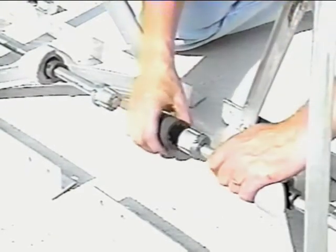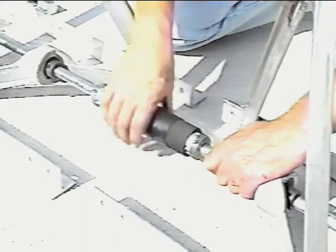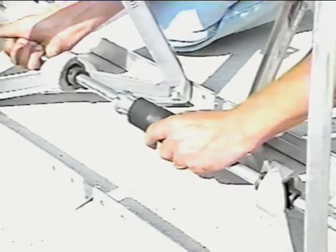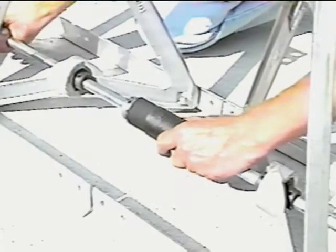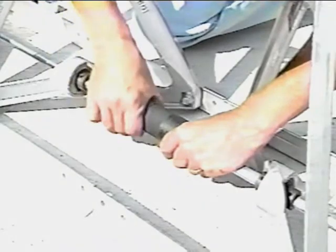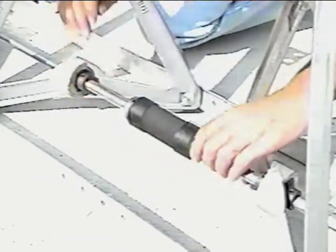There are 2 retaining rings for each coupler. Slide 1 retaining ring over each end of the coupler. If the fit is loose, deform the retaining ring to tighten. The ends of the coupler should be firmly sandwiched between each retaining ring and shaft driver. Sight down the top tubes of all screed sections and straighten if necessary.